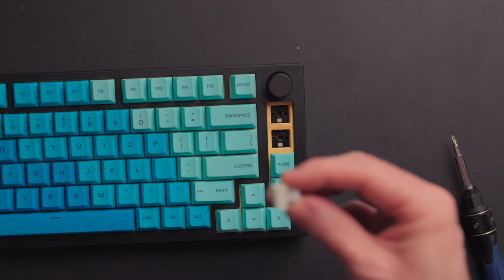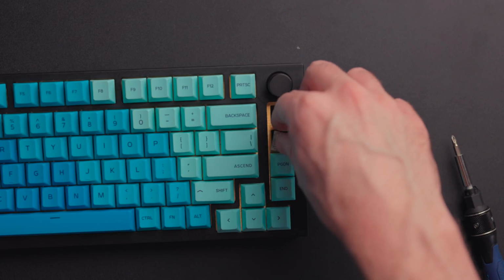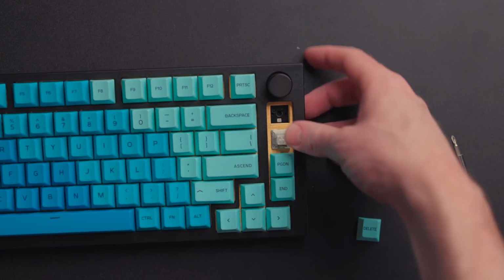All right, so it's a couple days later. I was able to finish the keyboard and everything works properly now. What this is called is a hot swappable keyboard. So key switches, they have pins on the end, and you just push them into the slot. Well, if you don't get them directly right on, you will bend the pins.